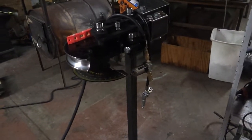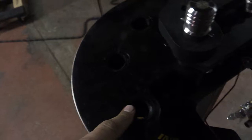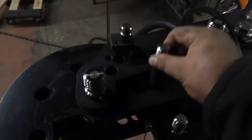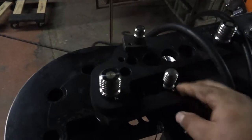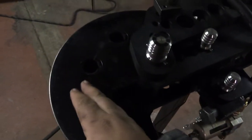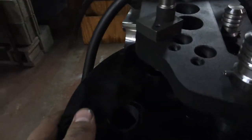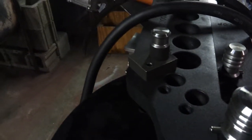Anyway, I'm going to hook this airline up and extend this to show you it at full extension. I'm also going to show you where it would be re-pinned. Just a quick heads up — these holes right here in the die are re-pin holes. And this pin right here ties the die set to this arm. As that arm pulls out, this die will turn. This pin right here is your anti-springback pin. When it gets to the next hole, it drops into that hole and keeps the die set from moving.